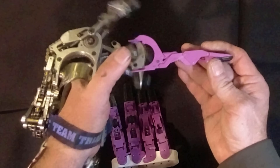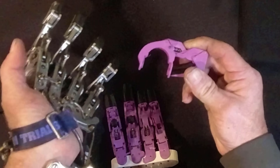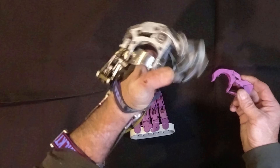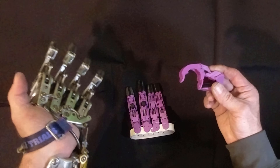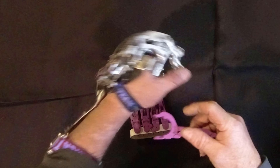So here it is. It's a crossed four-link design that allows for 250 degrees worth of motion with a little less than half an inch worth of input distance, which is really good for travel on the wrist, but really lousy for force multiplication.